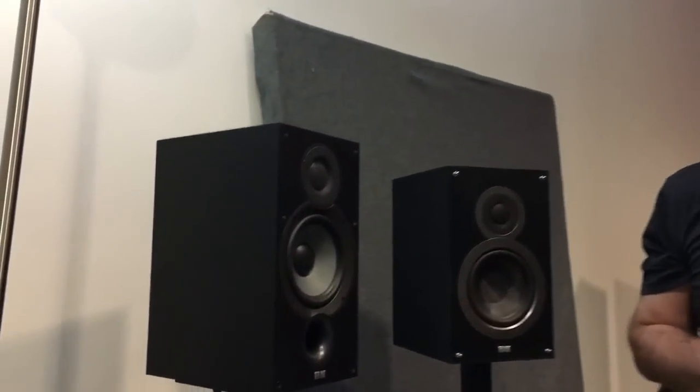Now, when we go to look at the woofer, we can clearly see differences there. Still woven aramid fibre, but a different fibre, a different colour, clearly, a different dust cap. We were looking at the top end performance of the woofer, and that's affected by the type of the dust cap and how it's glued and where on the cone it's glued. So I spent a lot of time playing with that dust cap to optimise that top end response and make it even smoother.